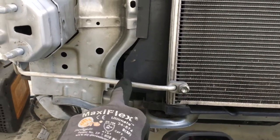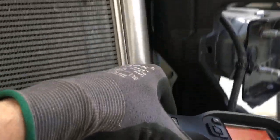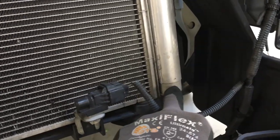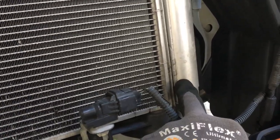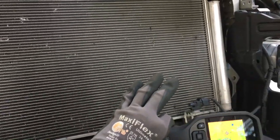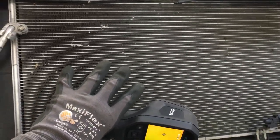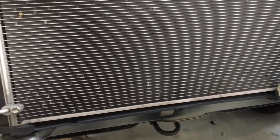This is the liquid line out going to the expansion valve. Here's the receiver dryer right here. This is all vapor up in here at the top three-quarters of the condenser, and it goes into the receiver, comes down, and separates out — all your oil and liquid right down here. There's a little hole through the receiver that transfers to these bottom few tubes. The car's been sitting overnight so all the liquid has fallen all the way down to the bottom of the tubes.